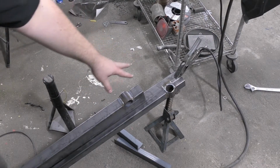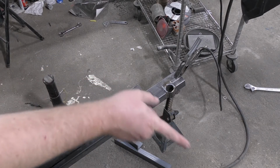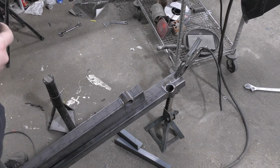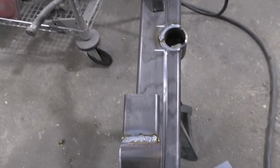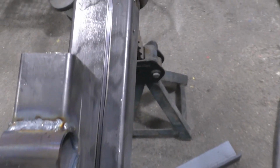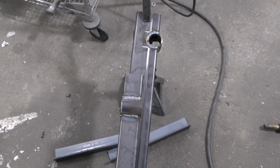Alright, so I got our pivot holes mounted. I got the 2 pivot holes for the attachment to the truck bumper. So these are going to be where the other set of ramps fold upon itself. So I still have to hack those out and put their little bushing guy in, and then we should be pretty good there. Definitely getting a little bit better with the plasma cutter. And then this old beater of a welder, some days you think it's just going to bite the dust, and then we put down some pretty respectable burns. I mean, in all actuality, if that came back from a welding shop, I wouldn't really complain.